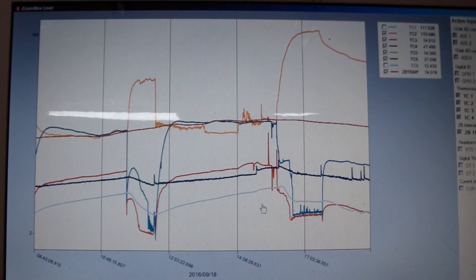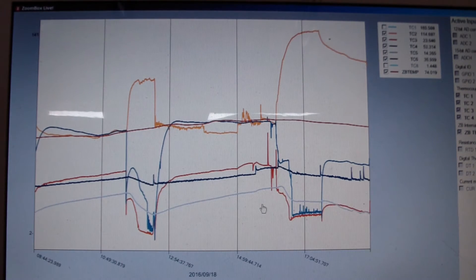As the paraffin melts and temperature builds, if the thermosyphon can't pull that heat out effectively, high-side pressure keeps climbing, pushing more refrigerant to the low side. More compression work means higher discharge superheat and even more excess heat dumped into the paraffin. The compressor kicked off at the end of the first run cycle. The cap tube was pretty damn hot to the touch, and though I'm running a heat interchanger wrapped around the suction tube, it was dumping a significant amount of heat into the suction line.